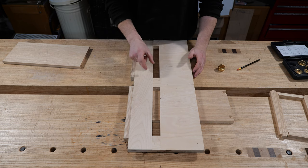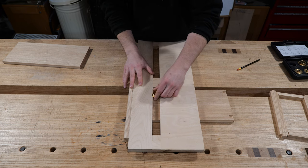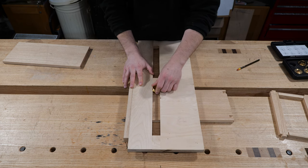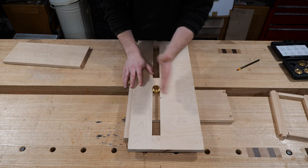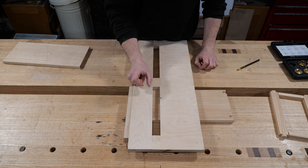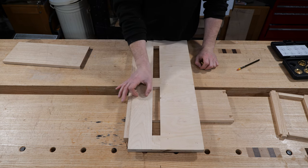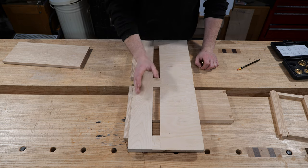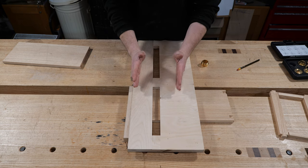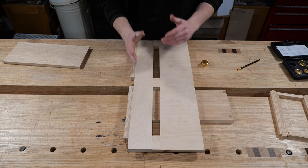What this will result in is the router cutting a groove that's prevented from going all the way through the front of the cabinet, giving us a stopped groove. This is done by using a guide bush attached to the bottom of the router — it needs to be a very snug fit within that channel with no lateral movement whatsoever. Although this jig looks somewhat complicated, there are actually only two or three parts that need to be absolutely spot on.